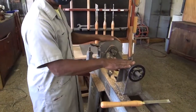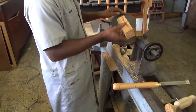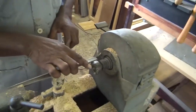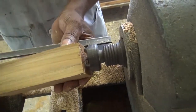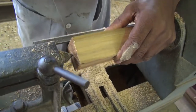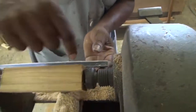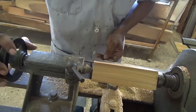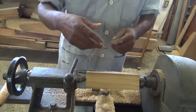Now, also, the motor is spinning at 2000 RPMs. That is the speed of the motor. So, we're going to line up now. If you notice the material, when we have done the dicing, it has two sides over the X, with one side lining up here and the next side lining up here. So, we come in here first, looking for the center, line up in the headstock, and we hold it. Then we come to the center of the tailstock and we line up the center. We just hold it slightly, and then we come back to the headstock and make sure that the fore cut fits in the jaw properly. Once it's lined up properly in the tailstock and the headstock, we tighten it properly. For extra safety, we have this lock here to lock it, so it's not going to run slack when we're in motion.